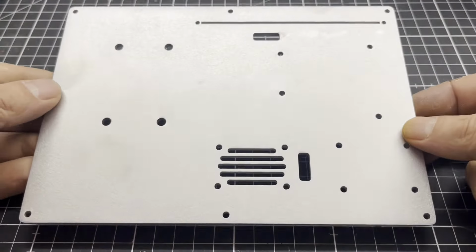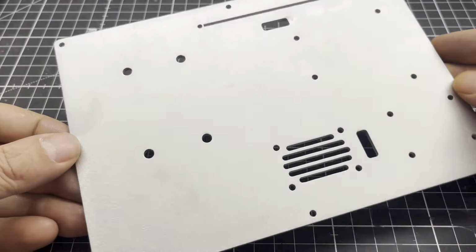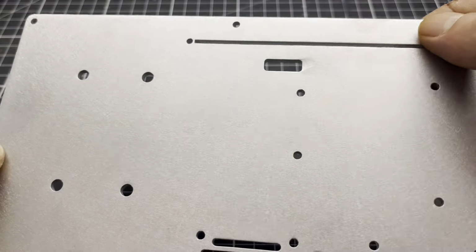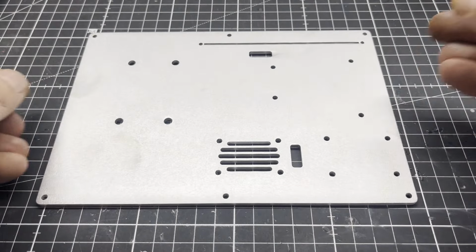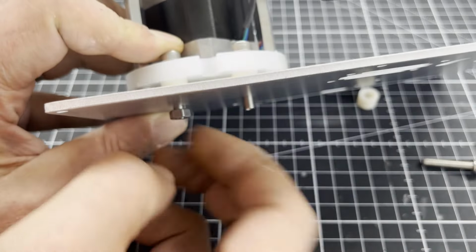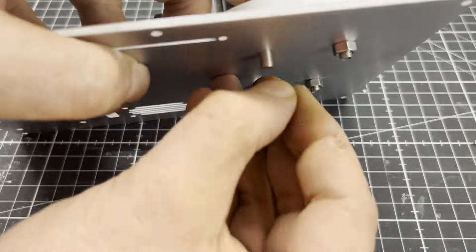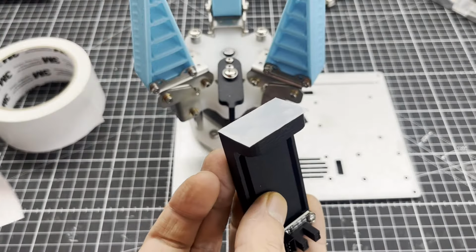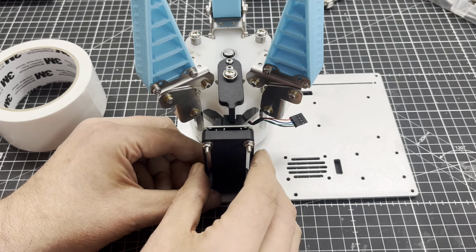The mounting platform was designed in Inkscape and laser cut from 3mm aluminum sheet by a company. Unfortunately, I don't have a laser cutter yet. The holes for the photo interrupter holder were drilled afterwards, after I had secured it in the correct position using double-sided adhesive tape.